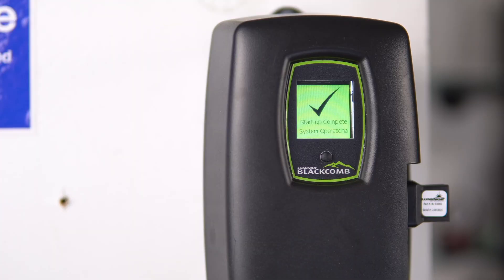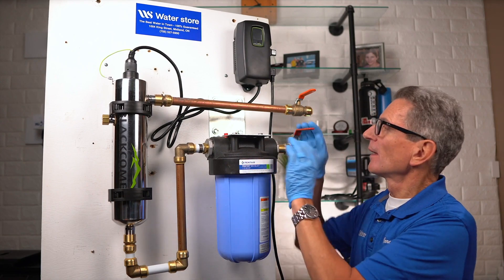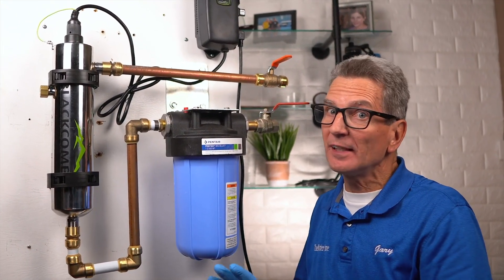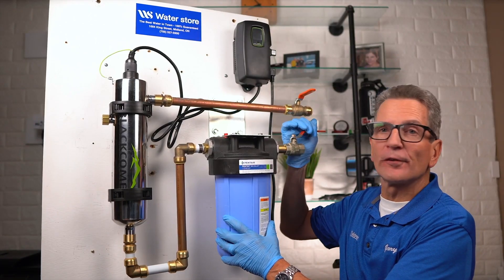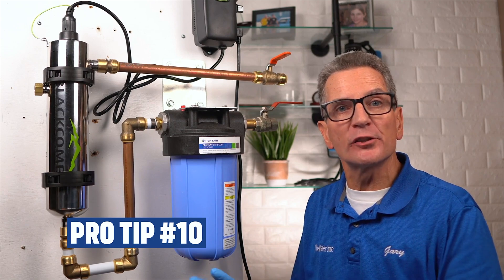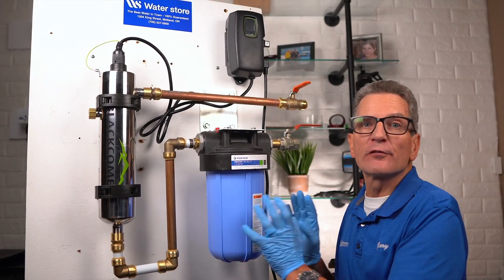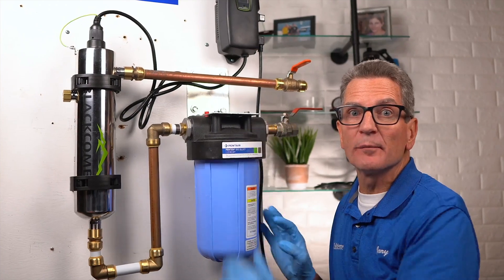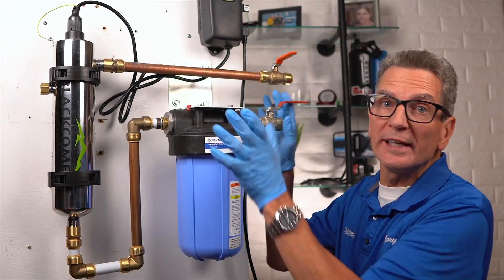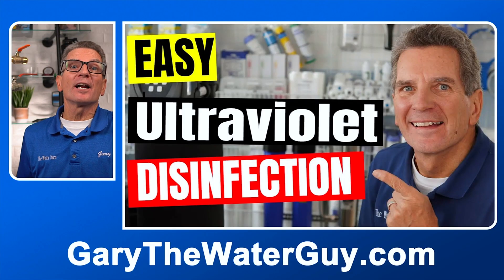Once the system is plugged in and powered up, close the inlet and outlet valves, then open up the water supply to run water to the whole system. Open the inlet valve halfway to fill the whole system with water and check for leaks — if you have any leaks, now's the time to fix them. Next, open the inlet valve fully and push the button to vent any air in the system. Pro tip number ten: it's imperative that the entire distribution system after the UV is chemically cleaned and disinfected, because any contaminated water already in the downstream plumbing could reinfect the disinfected water. I've got a YouTube video showing the exact procedure for that disinfection — link in the description below.